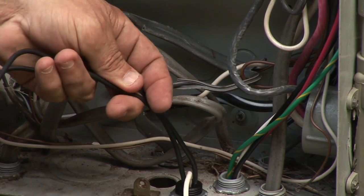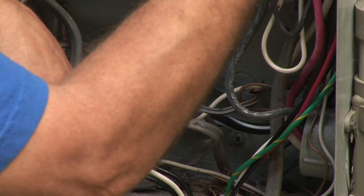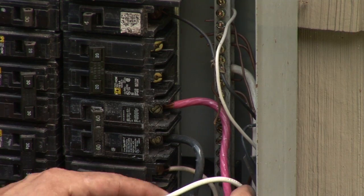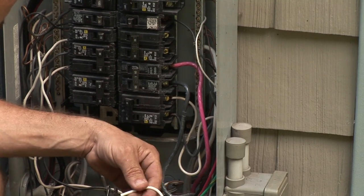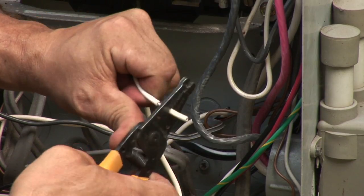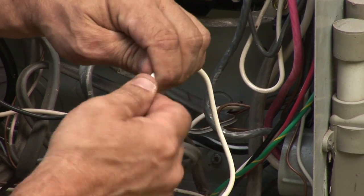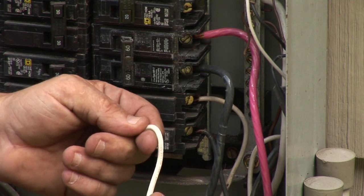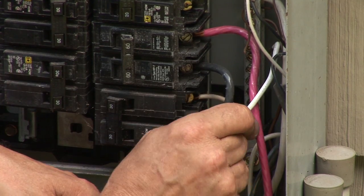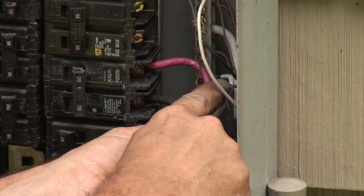As you can see, we have two black wires and a white wire. We find the white wire and the neutral bar coming into the panel — that is where the white wire goes. We make it a nice semi-tight fit. Use the wire strippers to strip off just enough. This particular one is a stranded wire. Most of them are. We can form this to go around and into the screw that holds the wire into the bus.